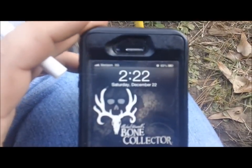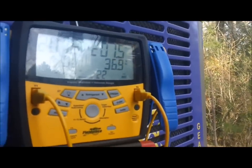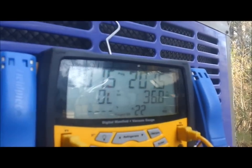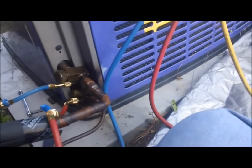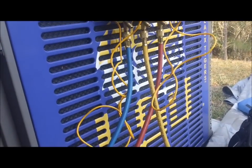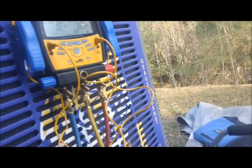We're back on the job - it's been about exactly 40 minutes. It looks like we've even risen a bit: we were at 200.6 and now we're up to 201.5. I'm gonna call this one fixed. That nitrogen has even risen a little bit, which is a good sign. I think we're good to go.